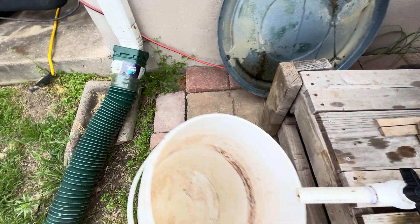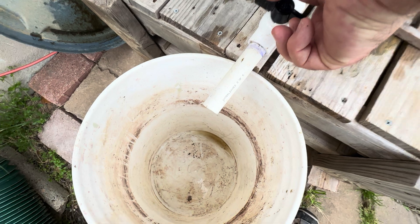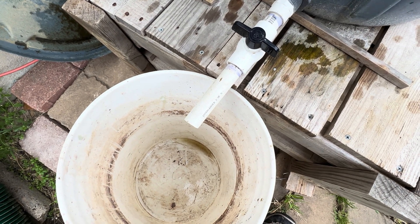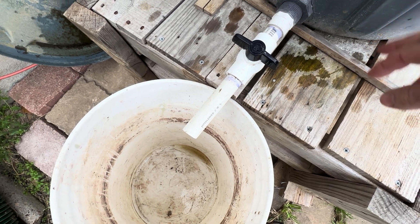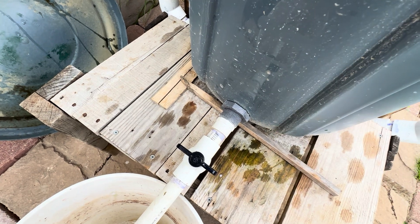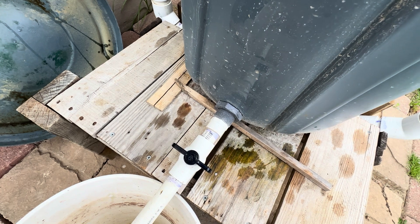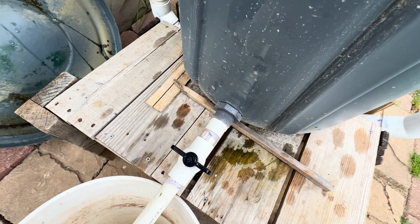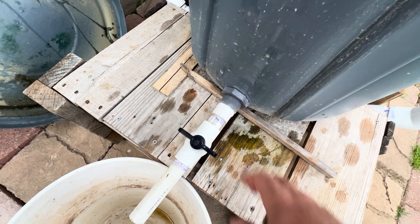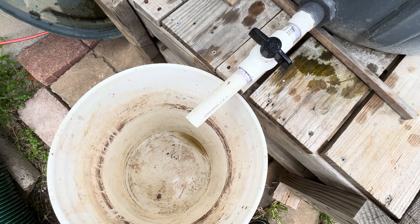Every day, at least once, you need to drain it, because due to the nature of a vortex, accumulated solids settle down onto the sides of the tank where velocity is low. Higher velocity means less settling of particles; slower velocity means more settling. So I have this valve to help drain out and suck out the settled solids.